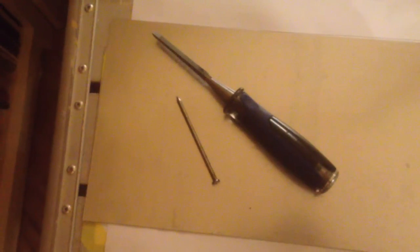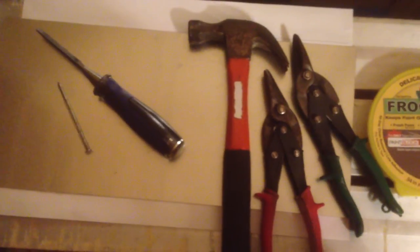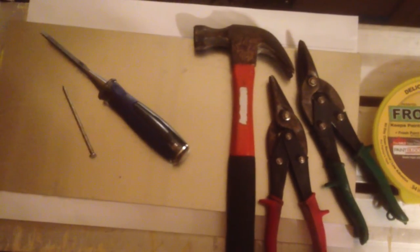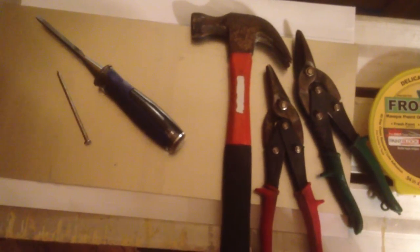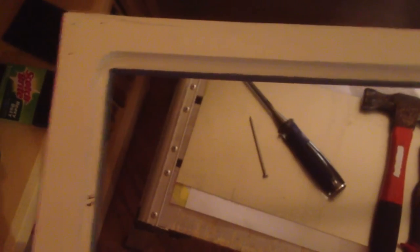My dot was even less expensive. Instead of a specially designed punch, I used a 20-penny nail. Other tools required at this stage were a good hammer and a pair of tin snips or aviation shears. My hammer of choice is a Craftsman 16-ounce claw hammer. If you don't have aviation shears, a good place to shop for them is Harbor Freight, where you can get an inexpensive set of three that will allow you to cut straight, left, or right. In my case, the panels will be inset into door frames; they fit into the routed slot on the back of the frame, and as a result, the corners of the metal will have to be clipped to fit using the snips. I had the advantage of a mechanical shear to cut my large sheet into four panels; if that had not been the case, those straight shears would have been required.